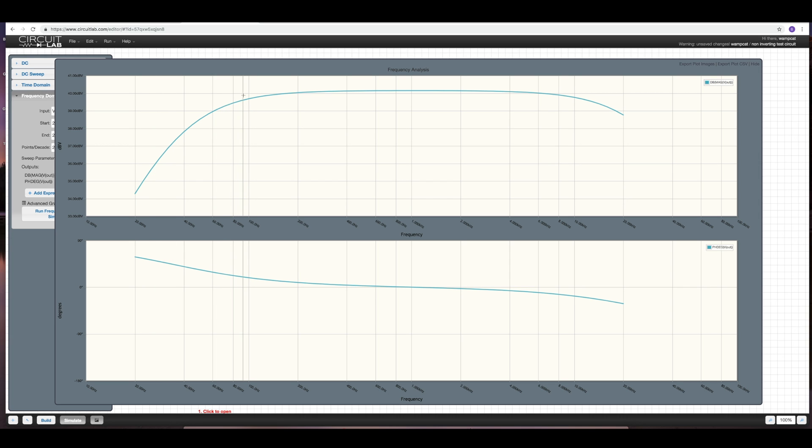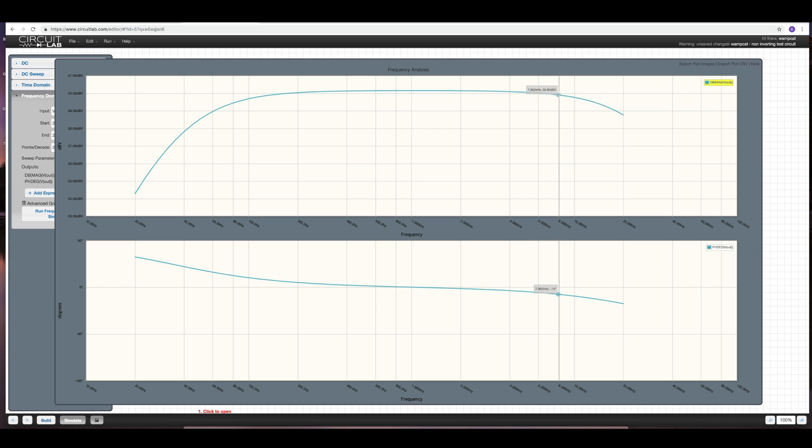You can see it's cutting at the very top — we're about 40 dB, and at the area that you can hear it looks like 63 dB. So about 20 decibels difference. You're going to hear a bit of bottom end; if you had a subwoofer hooked up you'd hear some of that. But we're playing through guitar amps so it's not that huge of a difference. And then we're starting to cut at almost 8k, just a little bit. That's just the limits of our op amp and the analog circuitry in general with this very simplified circuit. You change some things around and you're always going to have some sort of trade-off somewhere.